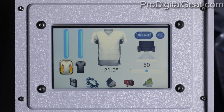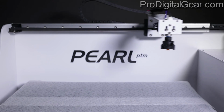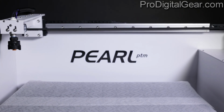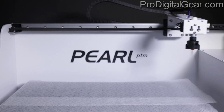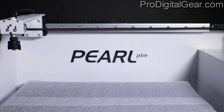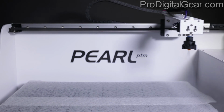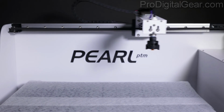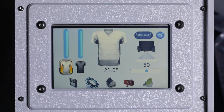Now to enable Speed mode, press the Speed mode icon. The nozzle cart will move to the starting spray length position prior to starting the spray cycle. After the spray cycle, the nozzle cart will return to the starting spray length position. This makes it faster to spray multiple shirts instead of one at a time. To turn off the speed mode setting, press the speed mode icon again.